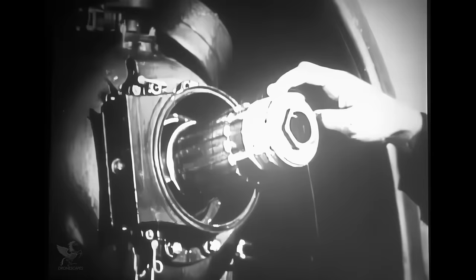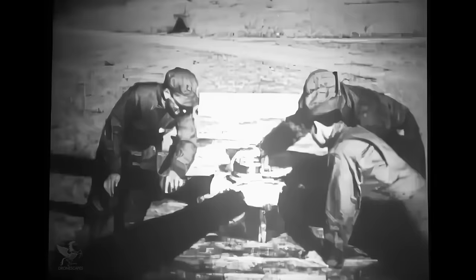The propeller lock nut threads are coated with the prescribed mixture of castor oil and white lead. While the shaft is being made ready, the protective coating from the propeller itself can be removed. The splines on the inside of the propeller hub are cleaned and oiled, and the slip rings are wiped clean of any oil or dirt.